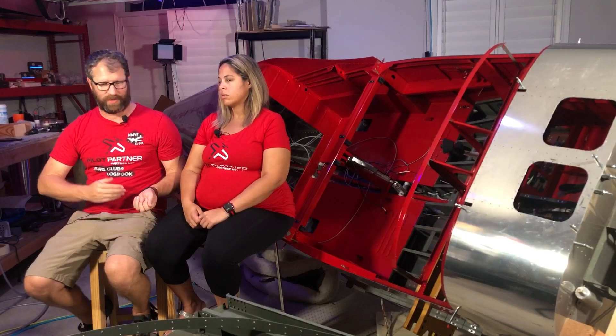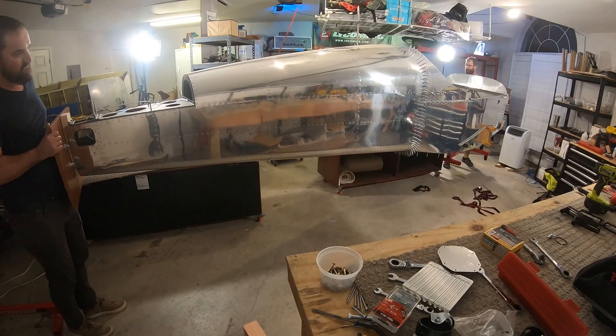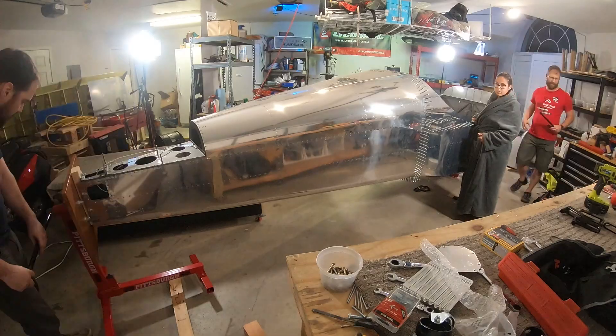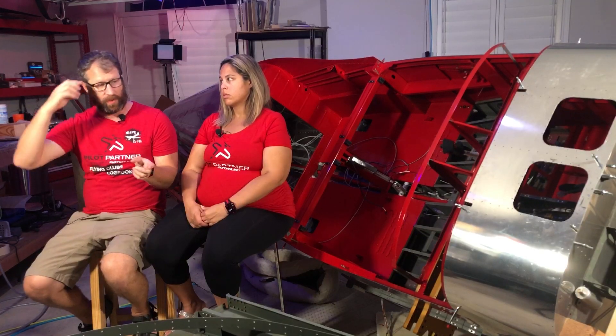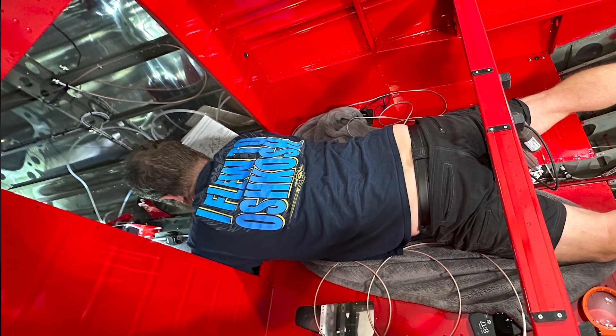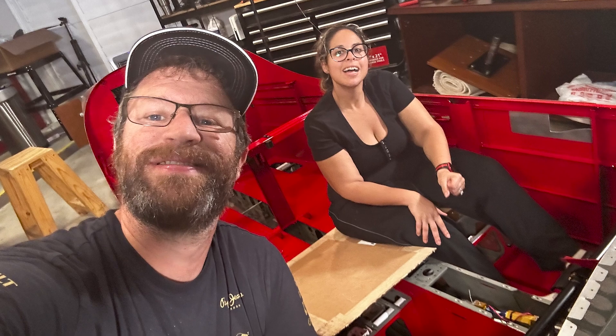Taking it on and off is not that bad. We're probably at the point where we need three people holding the fuselage and one person to slide the engine mount on and off. They have a snap ring that locks it in place, and once you pull that snap ring off, you can — once you take the weight off of it — just slide the engine mount out. Have two people holding the fuselage up front, someone go in the back, slide it out the back, and then gently put it down. Not everything you need to do can be done on the rotisserie. There are some times you're going to take it off — we took it off for a couple weeks when we were working back in the tail cone. I had to kind of climb way back in the tail cone; there's just no way I was going to get in there with the rotisserie. Call your friends over and have a plane moving party, and put your friends to work — that's half the battle of doing a build.